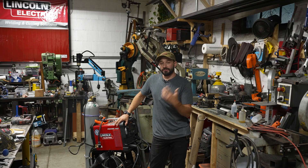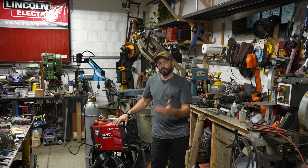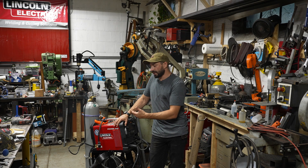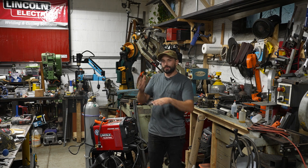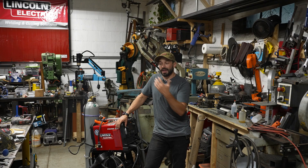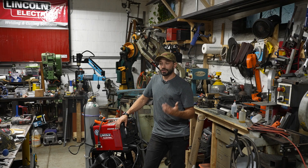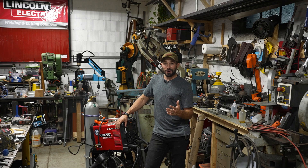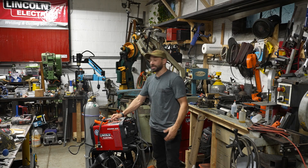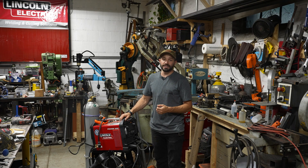The reason I'm choosing to fix this boat with the spool gun is purely for experience. I could definitely TIG weld this and I'd have a much more controlled weld, but part of getting better at a process is by trying it in a practical application. I've done a bunch of spool gun welding on practice pieces — two pieces of eighth inch in a T-joint, stuff like that — and in that controlled environment I can get a pretty decent bead. But on this crusty old aluminum boat, I don't know how the spool gun is going to react, and that's part of the challenge. What's cool about this is that I'm essentially going to be able to weld this aluminum with my MIG welder, which a lot of people have and don't necessarily have a TIG machine yet. So maybe this opens up some capabilities for you and your shop.